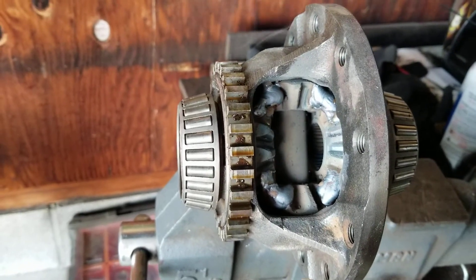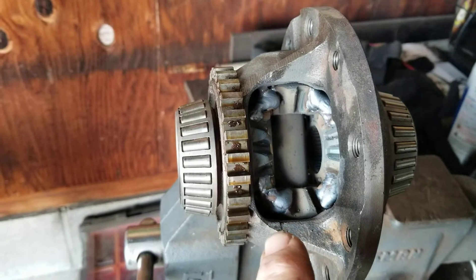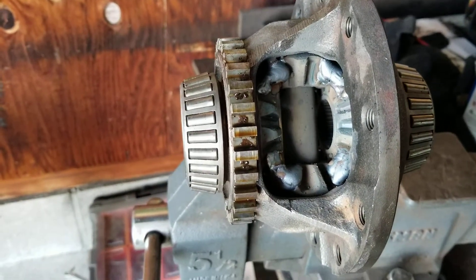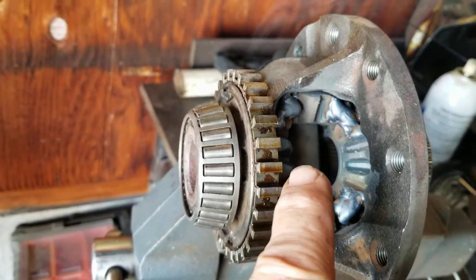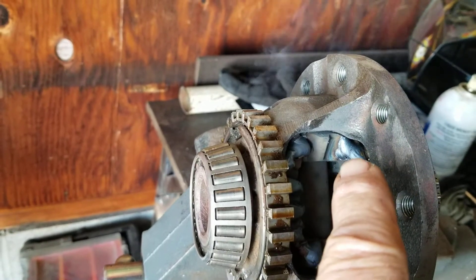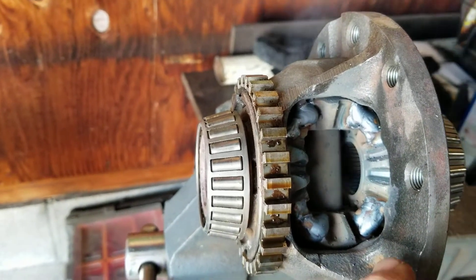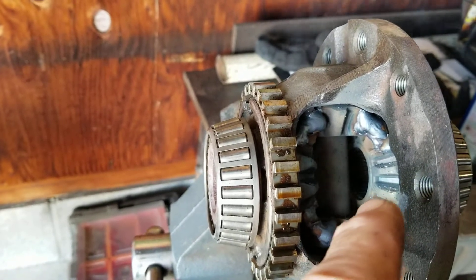You don't want to get it to the point where it's glowing cherry red — you just want to get it to where it just starts to turn color a little bit, just starts to pick up that glow, but not to the point where you're going to melt the gears. You work the weld back and forth; it's burned very deep into that intersection there where the gears meet, on both sides as well as down here. After you burn it into the corners, you slowly bring that out and then gradually build a bridge across.